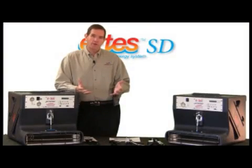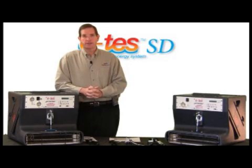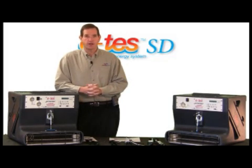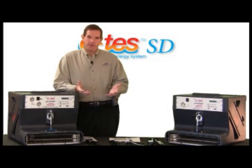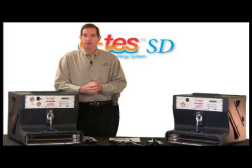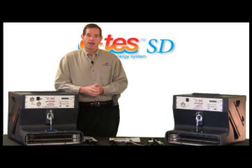Again, I'm really excited to introduce you to the E-TES Smart Dry, or SD as we'll refer to it. This unit uses the principles, as all of the other TES units have, of directed heat drying. You can now not only dry faster using directed heat drying, but the new SD unit will allow you to monitor the materials and the environment that you're drying in. It will allow you to control it with temperature settings, moisture content settings, and surface temperature settings. And best of all, it data logs it and then charts it.